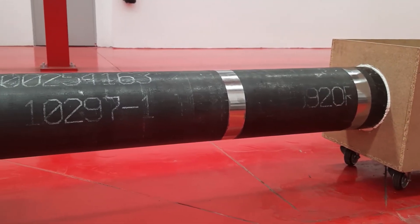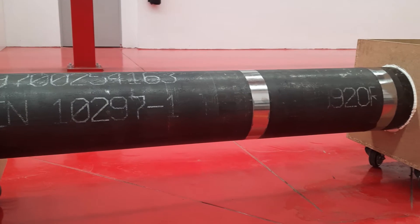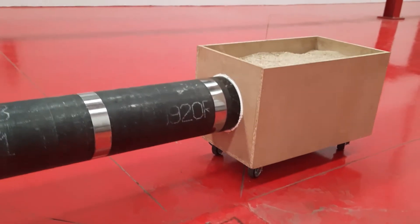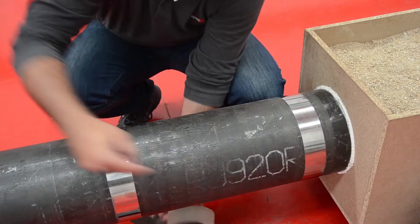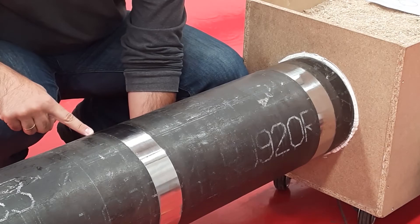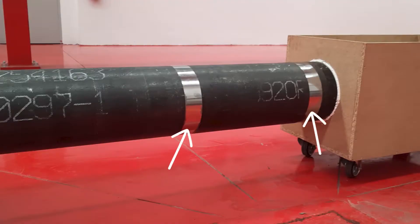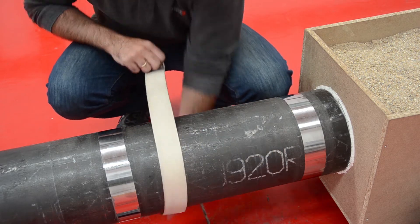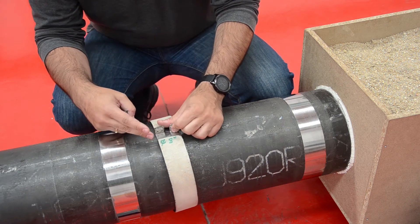We will generate medium-range ultrasonic guided waves that reach up to three meters on each side of the sensor when the bi-directional mode is selected. First of all, we need to decide where to place our magnetostrictive strip. We have already stuck it on the pipe with double-sided tape, but you can also use a tensioner with a pre-cut strip. The waves will be traveling axially in both directions.